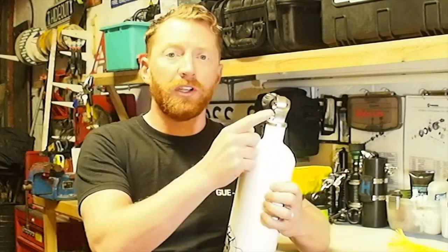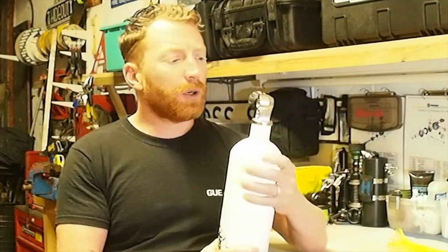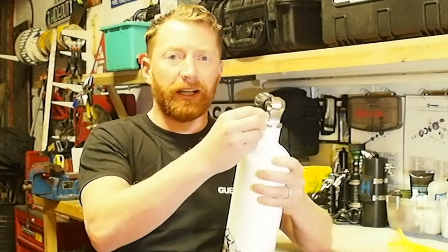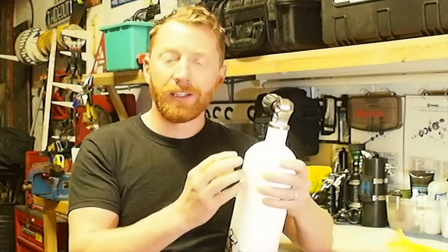As well as servicing, it's important to know how to maintain your own equipment. Looking at this pony cylinder: when stripping down your equipment at the dive site ready for refilling, there's likely to be some moisture within the pillar valve. To reduce this, grab the hand wheel, crank it open a couple of times, and watch the moisture get blown out as the gas exits the cylinder. This is important because with a steel cylinder, water getting inside will cause rust and over time can be detrimental to the life of the cylinder.